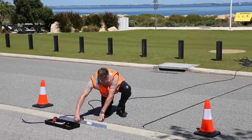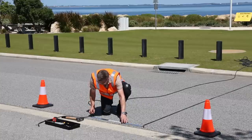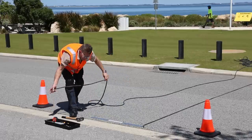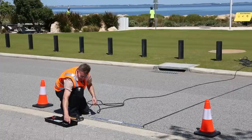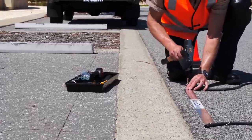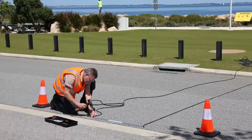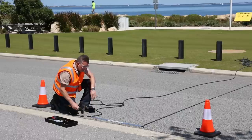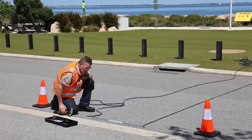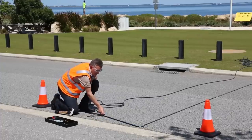Alternatively, what you can do is measure off one of the nails with your pre-prepared gauge - you can see I've got it spaced to exactly one meter. Get your figure-eight, nail, and washer, and using the gauge you just simply start your nailing hard up against it. One of the reasons we use aluminium is if we have a mishit we're not going to shatter anything. If it were timber or plastic you might end up breaking it, but aluminium bar is going to be very robust.